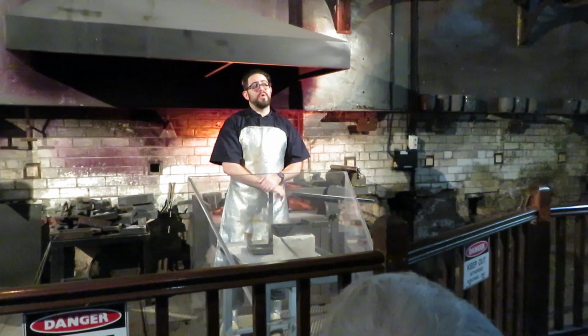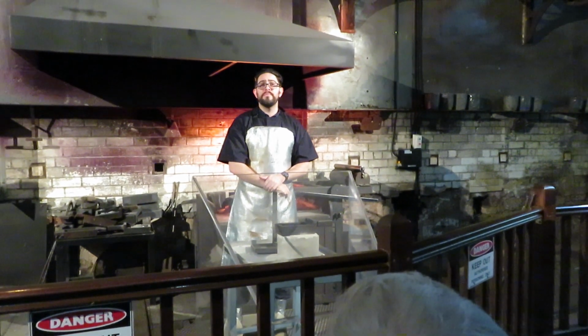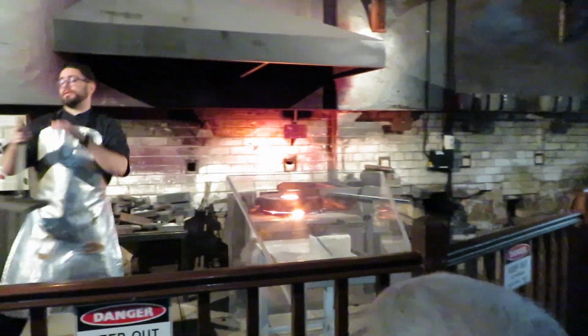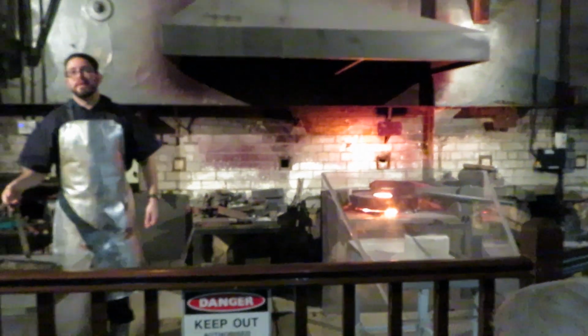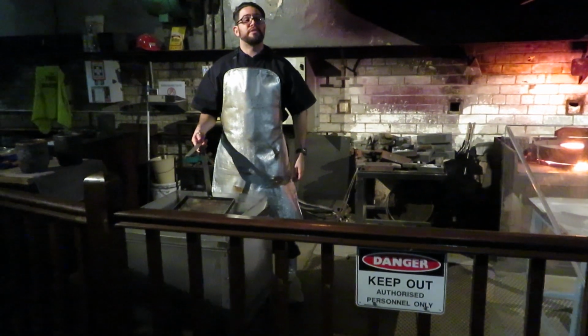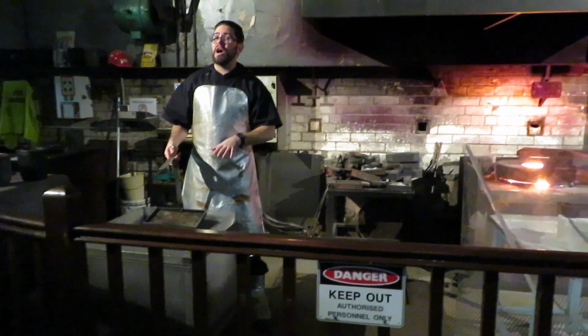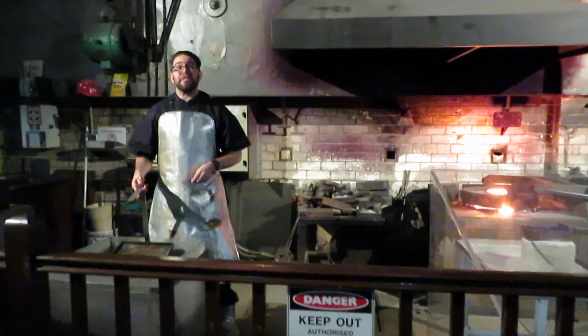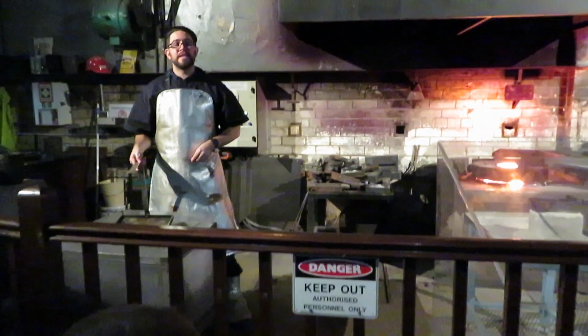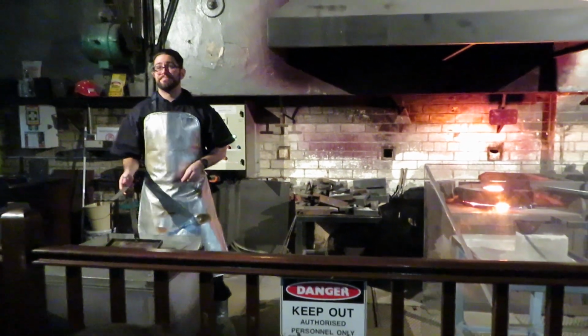So the gold bar is already completely solid the whole way through. I can tip that straight out onto my tray, bring the whole lot over to the quenching tank. Now that sounds pretty fancy, but in reality it's just a big square bucket full of room temperature tap water. But that will be more than enough to cool that gold down from around 1000 degrees Celsius down to around 10 degrees. So it's now safe to touch after about 20 seconds.